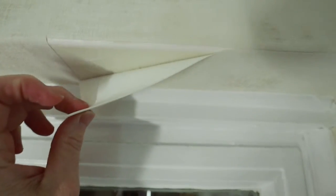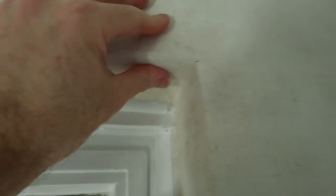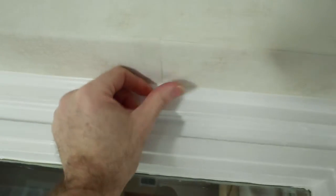That edge there, you see that edge there is butting up against that clean edge that I cut from this piece down. So that is what I'm going to be working on in a minute, getting the seam roller on it, getting a sponge, manipulating it so we get a nice clean joint. Oh, we've gone blurred, lost the focus. That isn't far off it. We've got a butt joint coming there, that's nice.